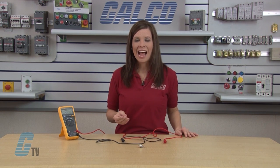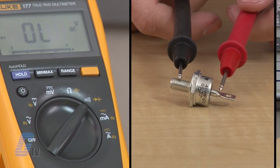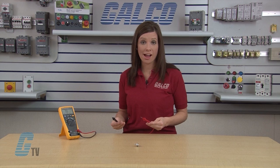Now, if I were to see an open or short circuit, this would indicate a bad diode. An open diode appears on the multimeter with the same indication you would have with the probes not touching anything — the OL on the display indicates open leads, or no continuity. A shorted diode appears on the multimeter with the same indication you would have with the probes contacting each other directly. The 0.000 on the display and the long continuous beep indicates a zero voltage drop and a shorted diode.